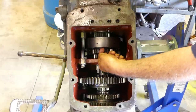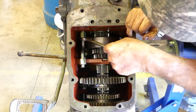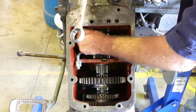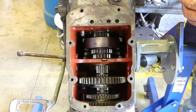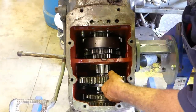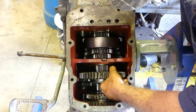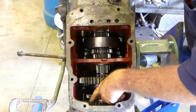So you've got your normal box here, then you have a clutch pack up here. This is your multi-power pack up the front. This pipe here, we might just undo that out of the way. Nice and easy to undo now. I'm not sure if it matters which way it goes. Now the multi, there's your main PTO drive coming in, and this is your main pack. Looks okay. On that bottom shaft I think there's a spline. There's a little bit of rust from where it's been sitting, but we can wash that off.